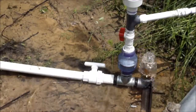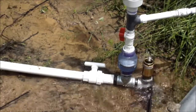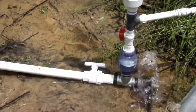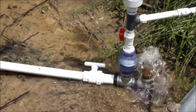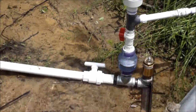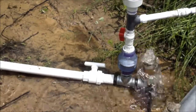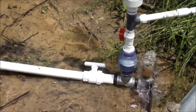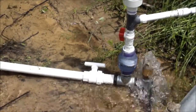That's a 1.5-inch spring check valve — a brass spring check valve that I removed the spring from. I put a tall nut on the end of the shaft with some extra weight on it. The other check valve is a plastic 2-inch PVC valve. You can see it's flapping open with each pulse.